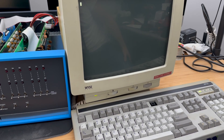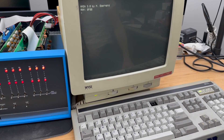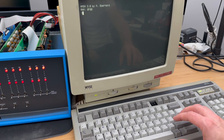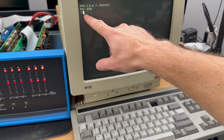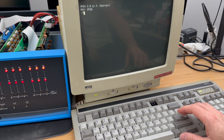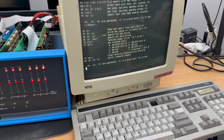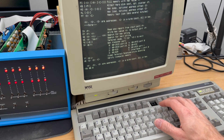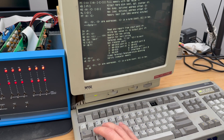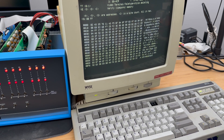Let's power up the machine and execute the program from the jumpstart address. It displays the same message as we saw in the serial console. Now let's input a question mark to access the help menu. Observe how the Altair relays keystrokes back to the terminal, just as it's supposed to do. I'm going to execute a command to dump memory across a range of addresses — typing DU with start address 00 hex and end address FF hex. Everything appears to be functioning correctly.